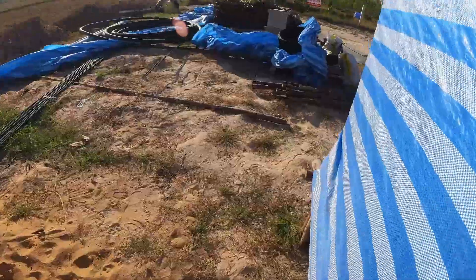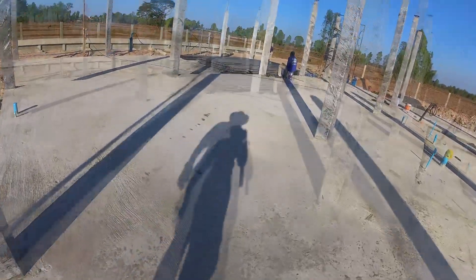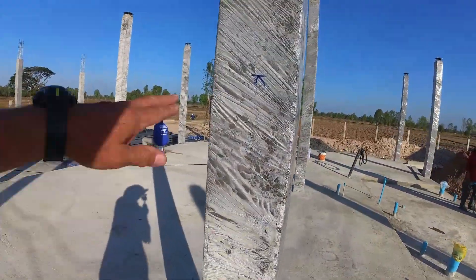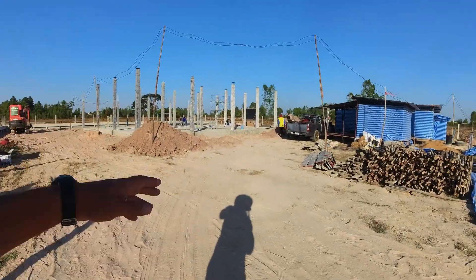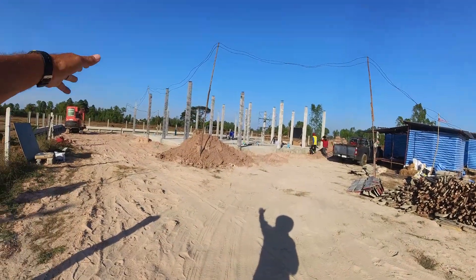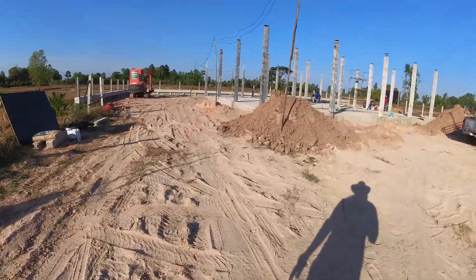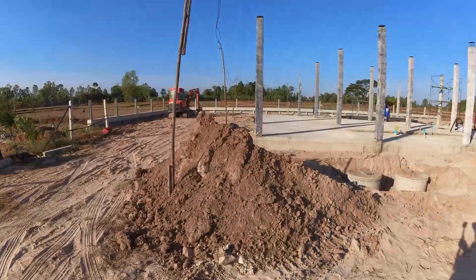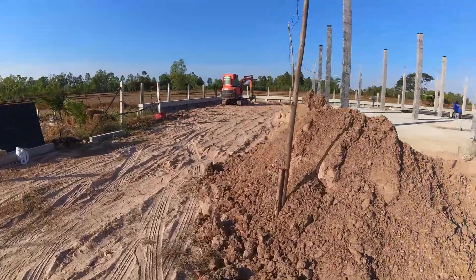Rocky and Cocky are gone — probably back in three weeks. This plastic is there to hold moisture in the concrete and keep it from drying too fast. It was cloudy and cool today, so I don't think there's any harm done. I told Sumpit this is when the house really starts to take shape — now you've got the beams up. Once the roof starts going on you'll really be able to see the true shape. The columns look pretty straight.